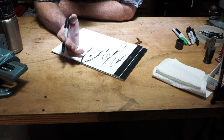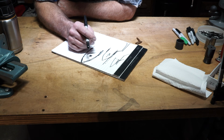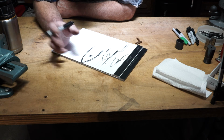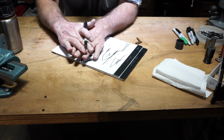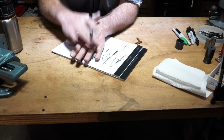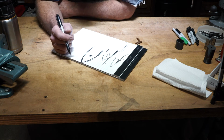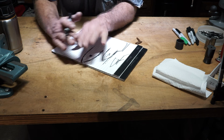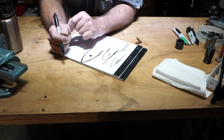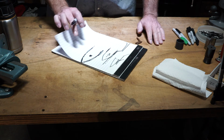Superglue has no shear strength. Interesting thing to know about superglue. On the mill, you can superglue a part down, work it, tap the side with a hammer, and it'll shear right off. Its whole lattice work lays flat. It offers a tremendous strength separating. They hang the guy from the helmet. If you're an old guy, you remember the motorcycle dude hanging from his helmet with a drop of super glue, okay? It has tremendous tensile strength, no shear strength. So, didn't do much for this. Epoxy has pretty good both, so I tried different glues.